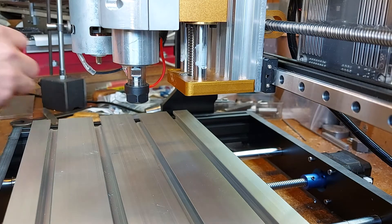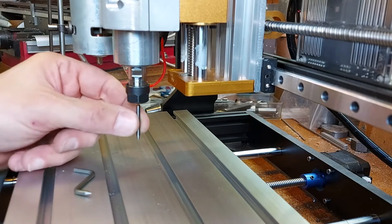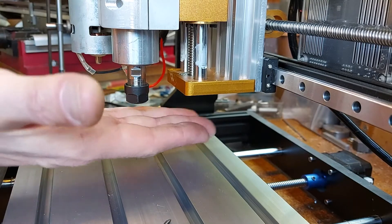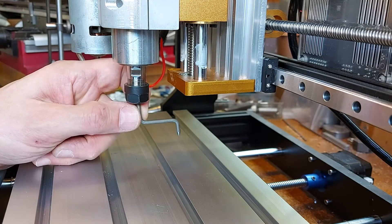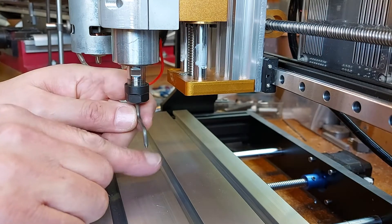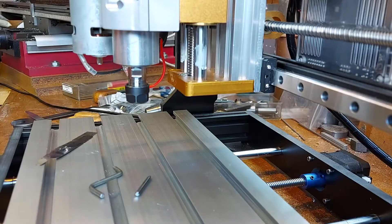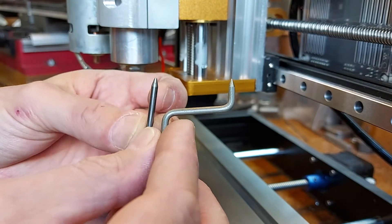That's where these two tiny pointers come in. A straight pointer that I can put into the spindle and measure the height at a number of points across here. And a dogleg pointer that I can swing backwards and forwards and effectively measure the flatness of the tip of the spindle compared to the actual table. Knowing that allows me to set the spindle square to the table. I want to get it the same height above the table left to right as front to back, and then it will be perfectly square. These two pointers are all you need really.